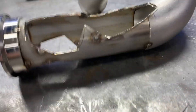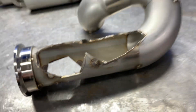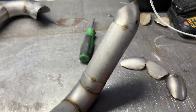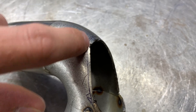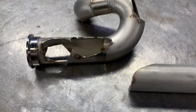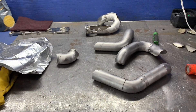Another good tech tip here — you can see I left some material, I didn't get all the way to the line. That's because when I go to weld some of these, there's a few joints here and it's going to want to tweak and move just a little bit. So when I come back I can cut it to fit and grind it so it's perfect. You don't want to go too crazy, then weld it, and not have it right. I've got everything prepped and cleaned, so now it's just time to start back purging and welding.